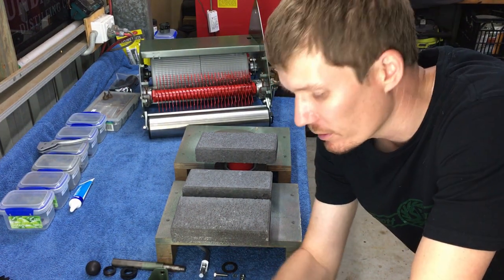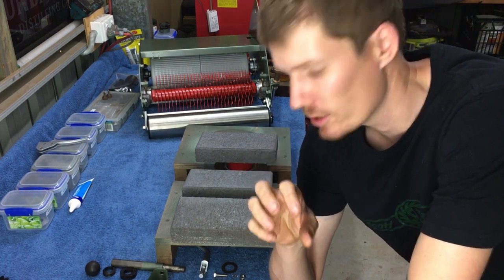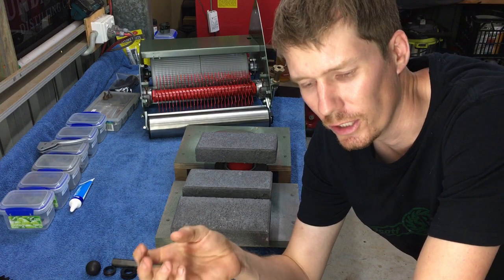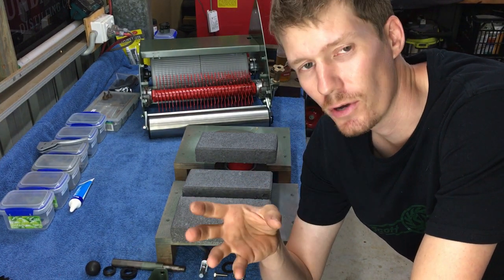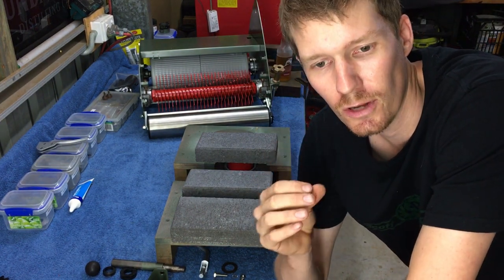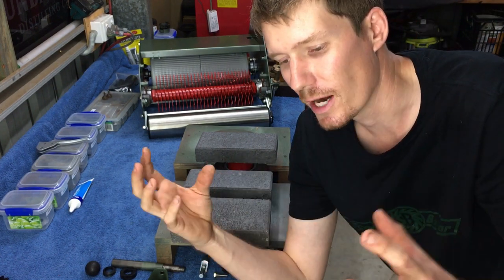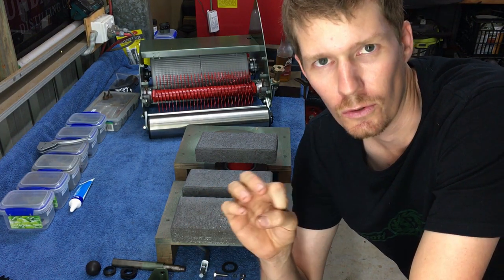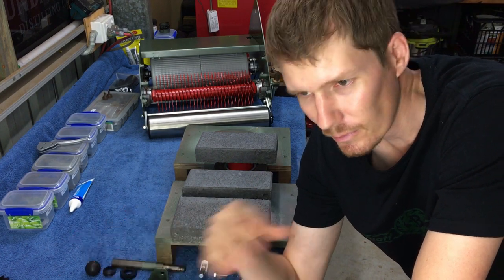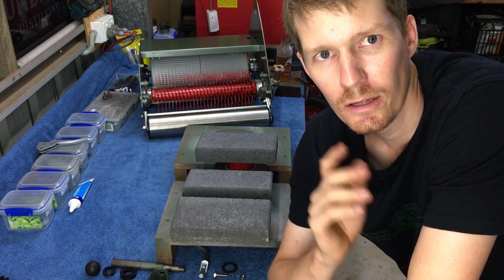So one thing to be very careful with is to make sure that you don't have any glue where you don't want it. So me sticking that like that with the weights on there, I've made sure that there's no glue on the outside part of the cork. If there is, you'll find that you've just glued those two parts together. Now you don't want to do that, and if you do happen to get some glue there without noticing, you're likely to find when you go to separate them that you'll pull off a chunk of that cork. If you do that, basically you're going to have to start again. So you have to pull that cork off, remove the glue, buy a new cork, and then re-glue it on there. So just be very careful.